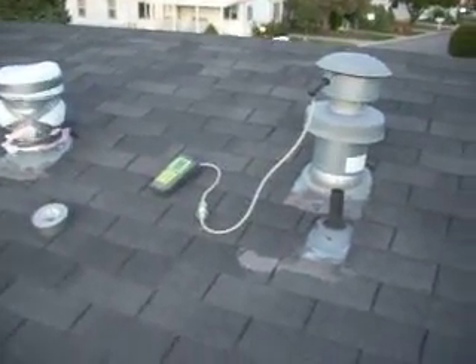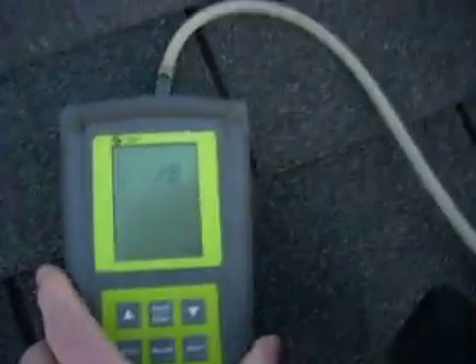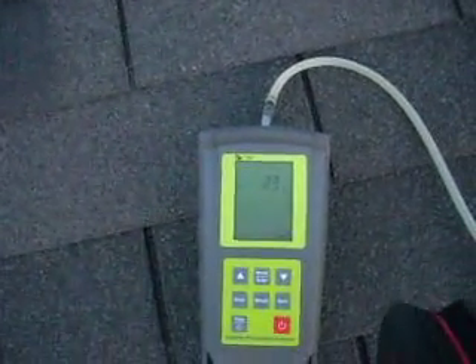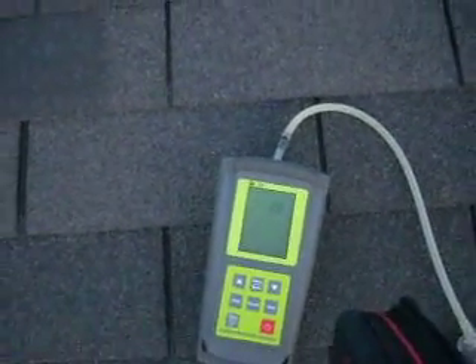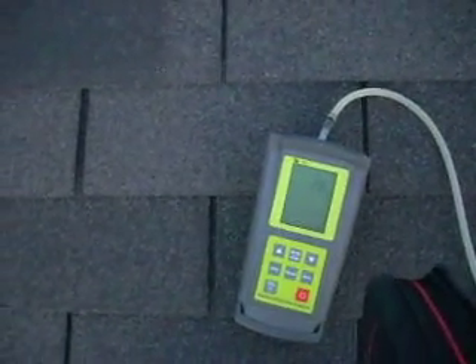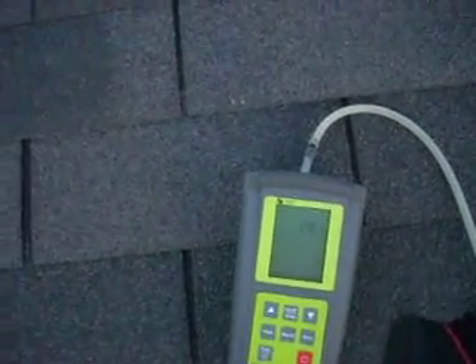As you can see I've got the tester in there, and right now there are 20 parts per million coming out of that exhaust. Over a long period of time, if that's drafted back into the house, that can injure a fetus in utero. The people most sensitive are infants and toddlers who are pretty much stuck inside the house every day and every night through the winter — and any individual, elderly and even adults, if subjected to a constant level of carbon monoxide contamination.